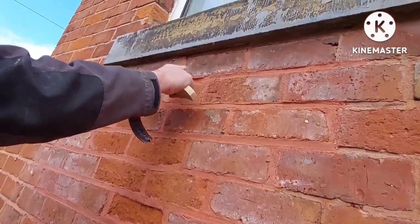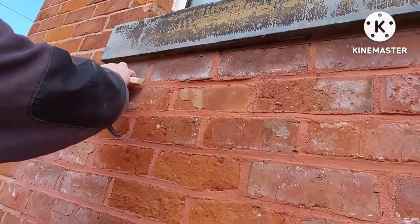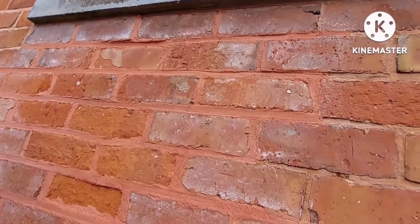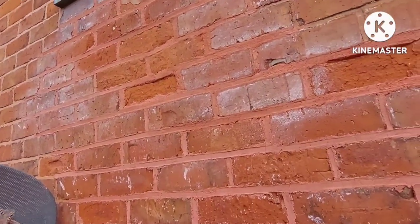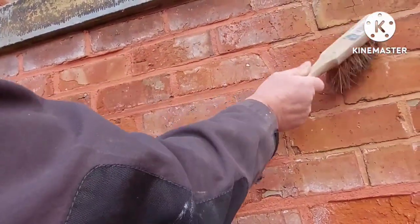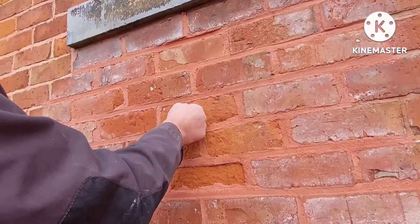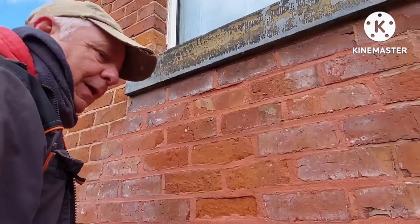Same up there — basically no mortar in these. That gives you the general idea of what you do. Then get a soft brush once you've done the stick and give it a light brush over, like so. You can go around with your trowel on any little bits you're not happy with, just straighten them out and flick them off — and that's pretty much the procedure up to now.